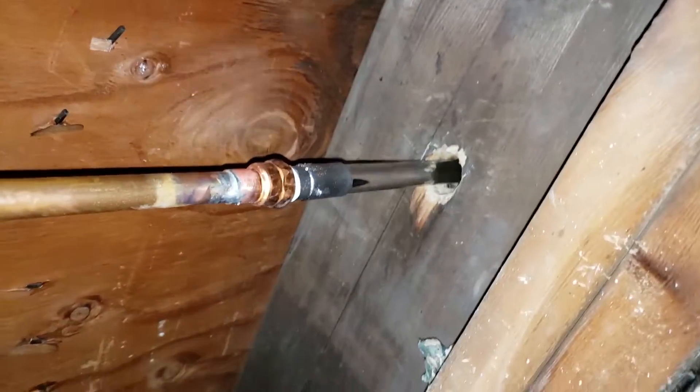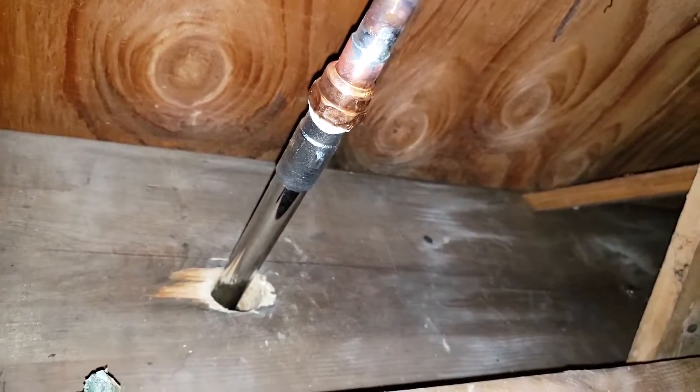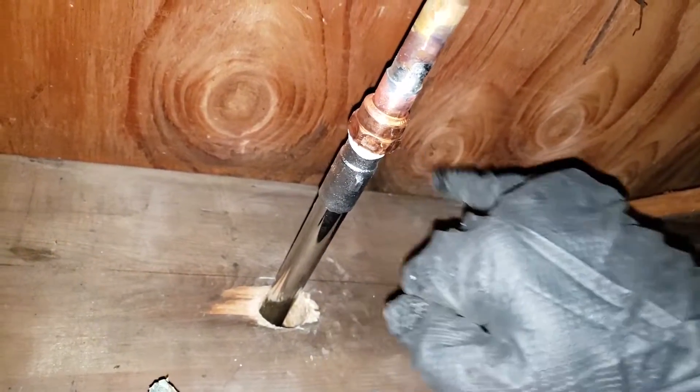Okay, let's try this again. Forgot something though — after soldering, always wipe off the pipe with a rag, because the flux is an acid and it'll keep corroding the pipe. Inspect your solder joint again. It's on my solder joint, but it is this joint right here.